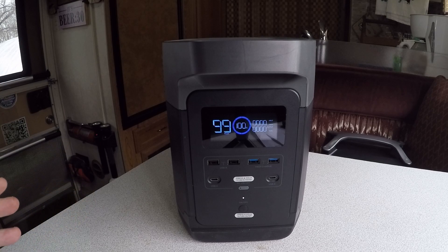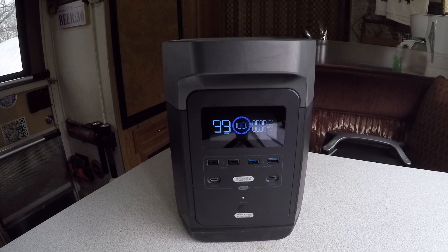The Delta family does have an expansion battery pack. It works on the Max and Pro models; I'm not sure about the straight Delta. Importantly, it's recommended that you add the extra battery right away with the unit rather than a year or two later. The cell management software balances all cells to the weakest cell over time, and adding a new pack later forces it to balance two packs together. It's also not recommended to remove and reconnect the extra pack once attached — it should stay on permanently.